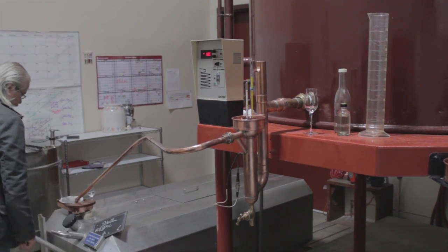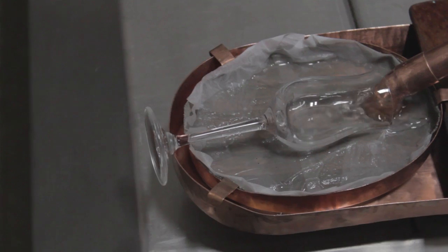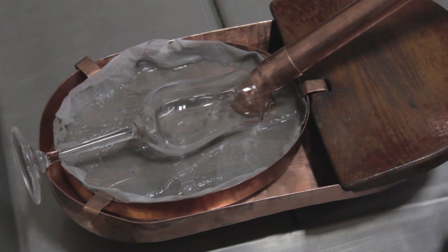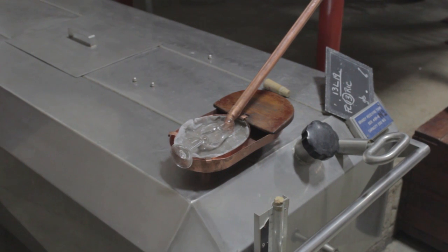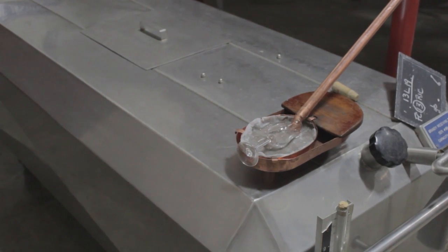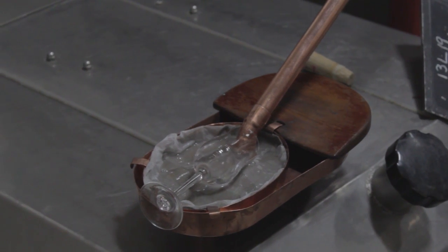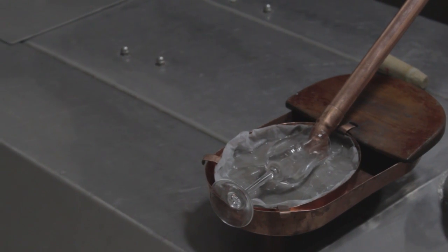He's making sure we put a little filter paper — basically not much different from Kleenex — so that the brandy passes through this filter before it goes into the holding tank. This is where it collects the fatty acids and the sulfur that are precipitating in contact with the copper, so that it doesn't go into the brandy.